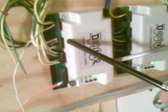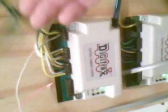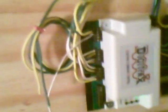One thing you may not know about the DS-64s is that they've got multiple functions. These actually operate with a snap switch. What I've done to test them is wire up a push button — I'll be running push buttons on the front of the layout. These are already programmed. To do that, you hook up to the common on the DS-64, right next to the positive feed coming into the DS-64.